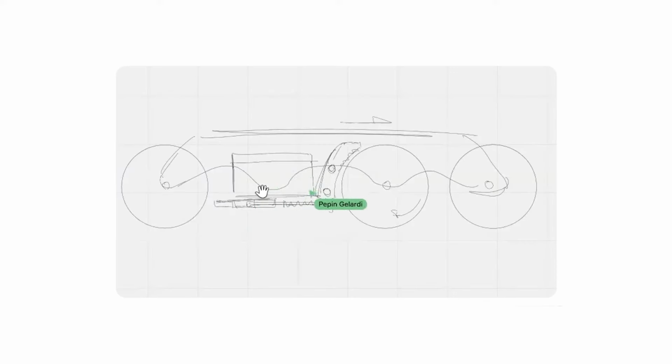So this is our servo. We give it some arms, right? The arm could be pulling on an extension spring, and then we would probably have some kind of lighter spring return force that just pulls this off of the wheel when it's not engaged. It would be nice to have just two screws that go through there that hold it in place. And then we need something to just keep it from rotating.